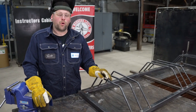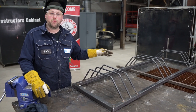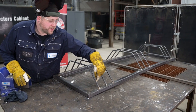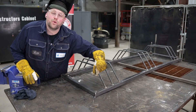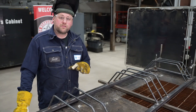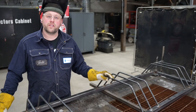I wasn't too worried about weld sequencing while I was doing this — reason being, I have the pre-bow. You may have noticed I spent extra time on the outside of these. That's because I didn't bother to cut a miter into the bottom of this; I just used the weld to fill it up. Now that the frame is fully welded out, we're going to leave it under that pre-stress until it's cool to the touch.